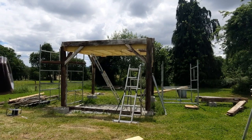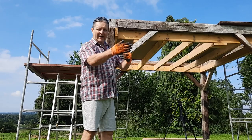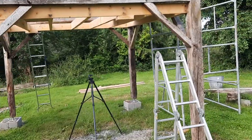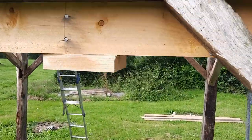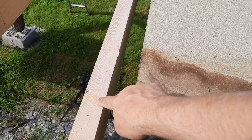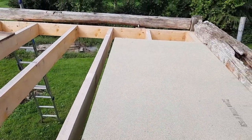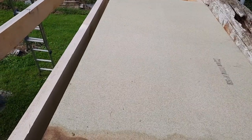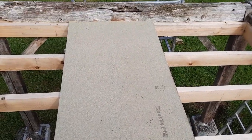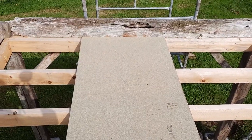Now when you're using boards and sheet material on joists, make sure you haven't got an overhang where the board doesn't meet the next joist — that's what they call a trap. You stand on that and it goes. This piece here is unsupported, it doesn't reach the next part. You could put two fixings in there with some temporary cross pieces underneath, but that's a bit time-consuming. The better way is to take the board and run it across the floor joists so there are no hidden traps.